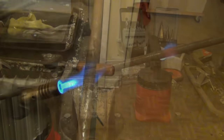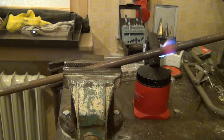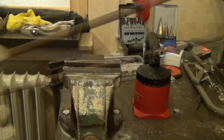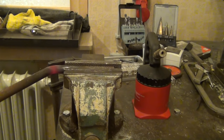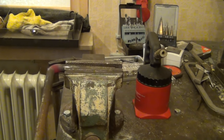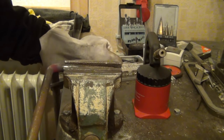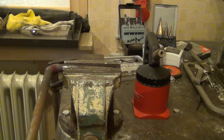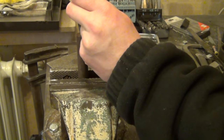I took a piece of round steel and heated it up with a gas torch until it was red hot at one spot. I then bent the steel to a 90 degree angle — I did this because I wanted to create a lever. I had no idea how much force would be needed to open the lids, that's why I made it this big. The idea was to form the tip of the steel in such a way that it would fit the lock in the middle of the rims. For that, I first punch-marked the tip and drilled a hole into it.